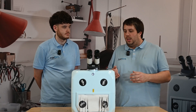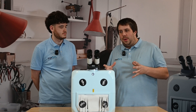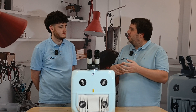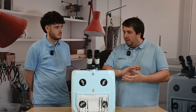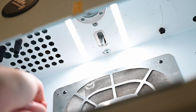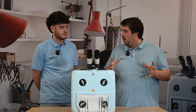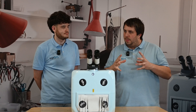Another parameter you can change is the beam size. For most jobs I'd say you want to use a small beam because you want to make a nice strong join, but you can open that beam up to smooth the job over. In laser welding the job can be a little bit messy, but you can do the cleanup after using that bigger beam. That's a dial on top of the chamber — furthest away from you for a small beam, closest to you for a larger beam. A lot of the time I only bring it back a touch just to open it up a little bit.